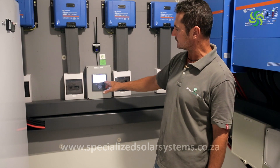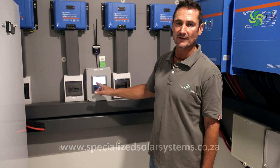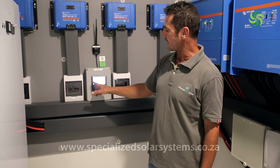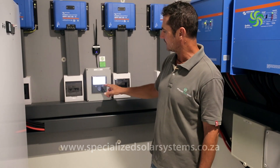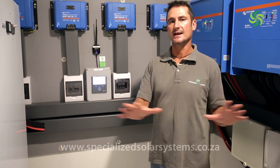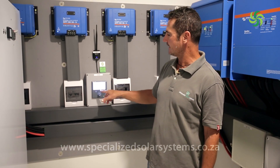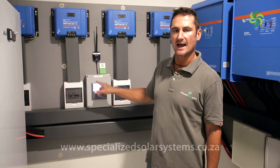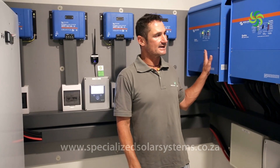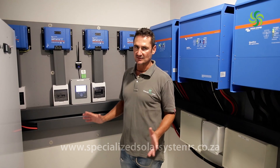On this display you can see exactly how much power is being produced by the solar panels. Currently the panels are producing over seven kilowatts. Most of that power is being used to bring the battery up to 100% — right now it's sitting at 98%. The rest of the solar power is being fed to the three phases connected to the grid on the property — L1, L2, and L3 — and we're using just 38 watts from ESCOM as an AC reference to the Victron inverters.